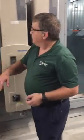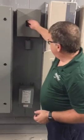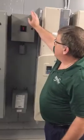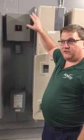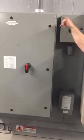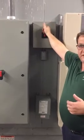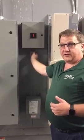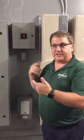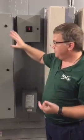So, following from that, this is a step down. What we do is so you don't have to run a 120 volt service and a 460 volt service. We have a 460 volt service that comes in here. Then we have a step down, and we have a fuse disconnect separately for your lights and GFI. That way, there's less installation cost. So it's already built in.